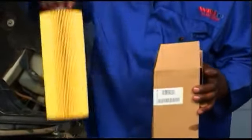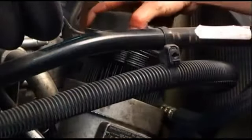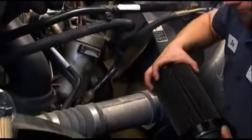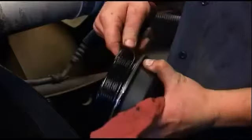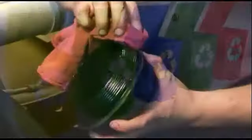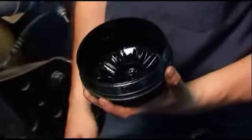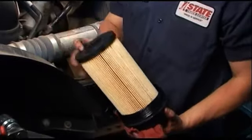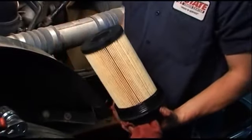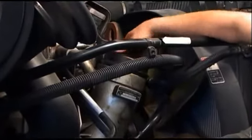To properly install cartridge lube filters, follow these steps. Before installation, loosen the cap and remove the cap cartridge or element assembly. Drain and dispose of the used cartridge and remove the old gasket from the cap. Dispose of both in accordance with local disposal guidelines. Clean the housing seal area and cap with a clean cloth. To install the new cartridge, first fit the new gasket into the cap. Place the new filter cartridge into the cap. Reinstall the cap with the filter element and tighten the cap to its proper torque.